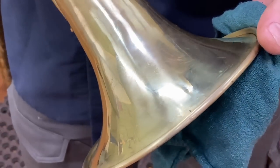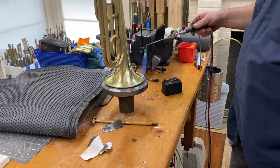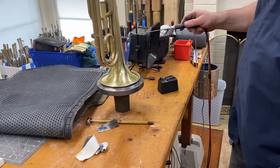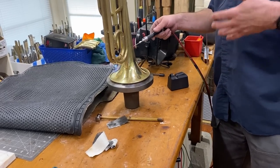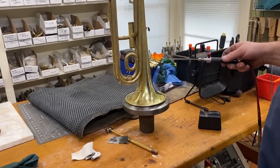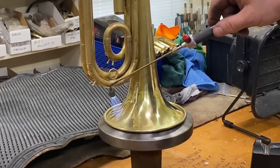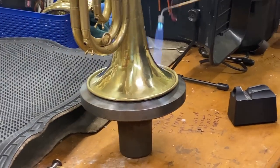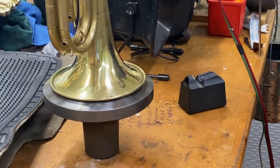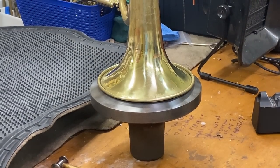What do you think about that? That's pretty good. Really a pretty lazy flame — the steel is going to act more of a heat sink so the brass isn't going to get too hot. Just want to kind of normalize it, let everything kind of come back to where it was. No stress. I'm figuring that the instrument is about 90 to 100 years old. With a little bit of heat oxidation you can blend the color back so that it blends in with the rest of the brass — it's another little trick. That's beautiful. It's going to be alright.